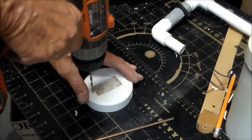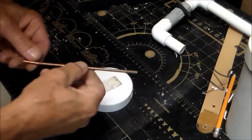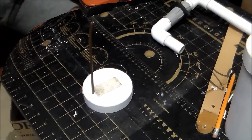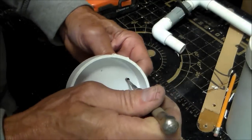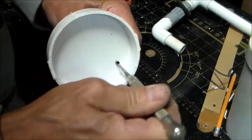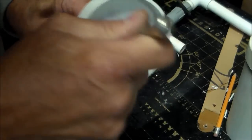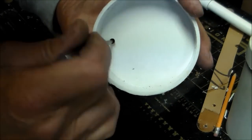The bottom of this water chamber has to have a drain tube. I drilled a snug hole and inserted a copper tube into it. Using a pointed awl I'm inserting into the end and rolling it to start flaring the end of that tube, making it funnel shaped. I will continue doing this with a larger tool until I can peen the end over.